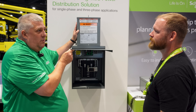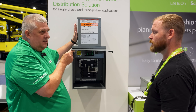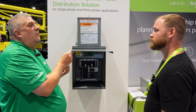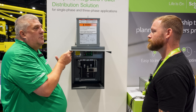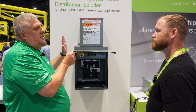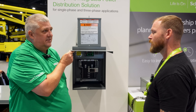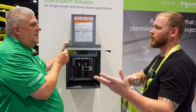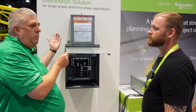The transformer is embedded in sand and resin — it's a resin encapsulated transformer, specifically designed for outdoor applications. We do offer it in a complete stainless steel enclosure, so if you have a corrosive environment, we can offer it as a Type 3X application. It comes standard as 3R, but is also available in stainless steel. We designed it as 3R so you can place it wherever you want.